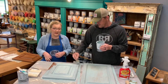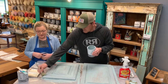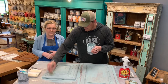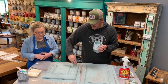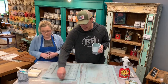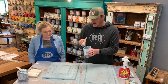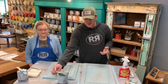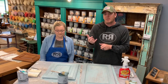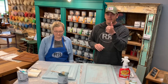It is a water-based paint, so you can add a little bit of water to thin it down, but not too much — maybe 10%. Remember, chalk paint always takes best to chalk paint, so your first coat might not look great, but your second coat is going to get that full coverage you want. We're not really worried about coverage right now — we're just getting paint on there almost like a primer coat. Let that dry for about two hours, making sure there are no wet spots, because the next coat of paint will actually pull that paint up.